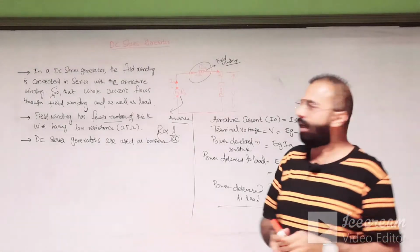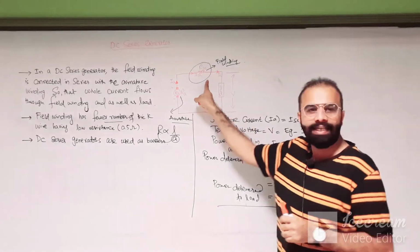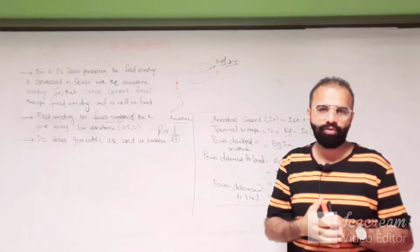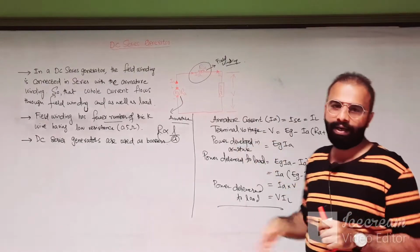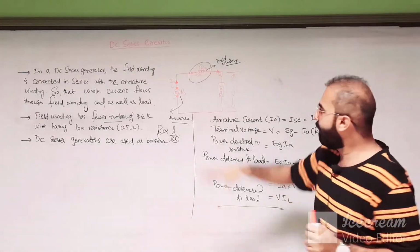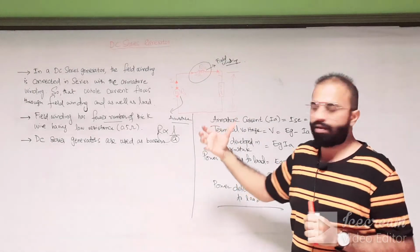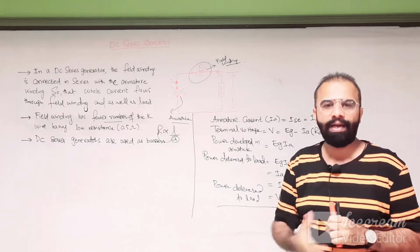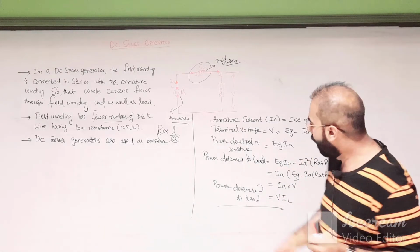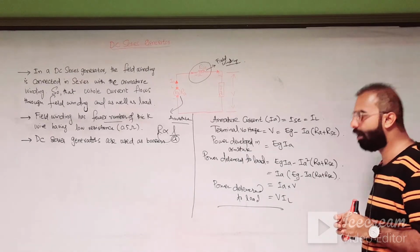So this was the whole lecture regarding the DC series wound generator, in which the field winding is connected in series with the armature winding, so that the whole current flows through the field winding as well as the load. The series field winding is designed with a fewer number of turns of thicker wire having low resistance. And we have also discussed some formulas related to the DC series wound generator.